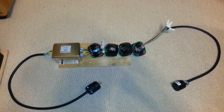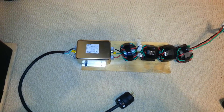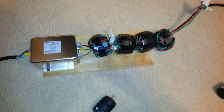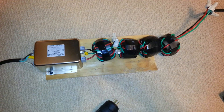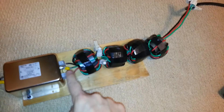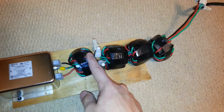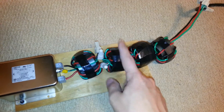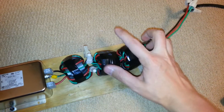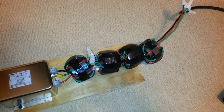As mentioned before and as shown in previous videos, I had a 16FC Corcom filter, but I realized that wasn't enough so I decided to get some ferrite toroids — type 31. I'll link to the part number in the description below. What I've basically done is taken the ground, the neutral, and the hot, wrapped all three wires 4 times around each toroid and put them in series. So basically I've got 16 turns around type 31 ferrite.